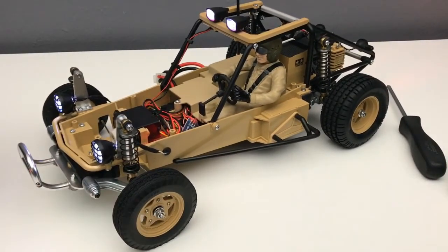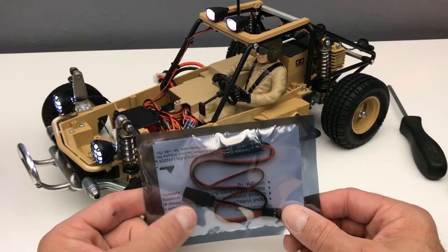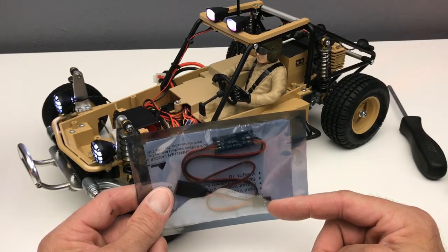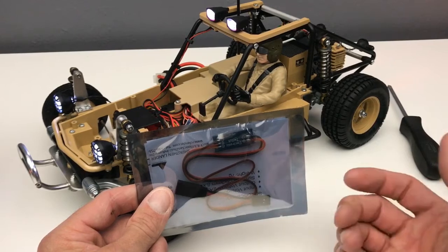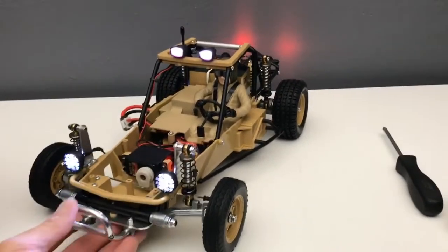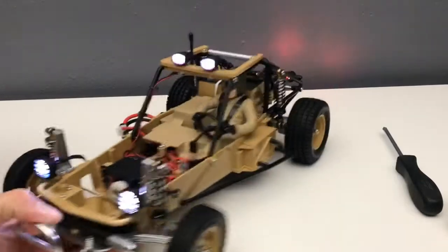I'm using this little two-way switch right here — you can get these on eBay, I'll put a link below. It's advertised for aviation use. You plug it into your receiver and it's got a female plug on the other end where you can plug your regular RX plug in — just a two-position switch. You're drawing six volts from your receiver and this goes on a two-position switch: switch it on, power on; switch it off, power off. I tied the actual light module into there, and that's how I got it to work with the two-position switch here on the DX4. Down is off, up is on — all powered by the receiver.